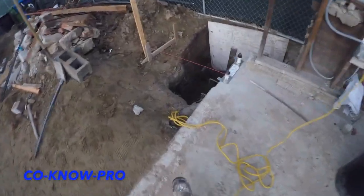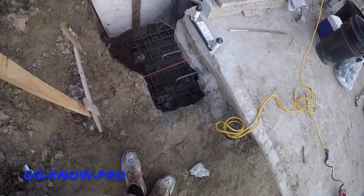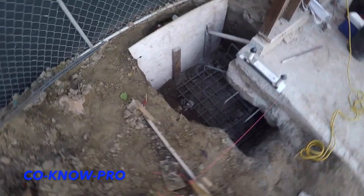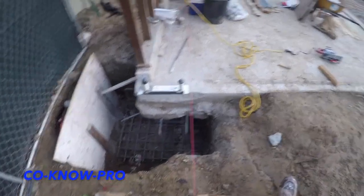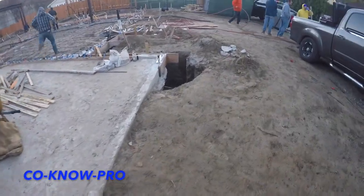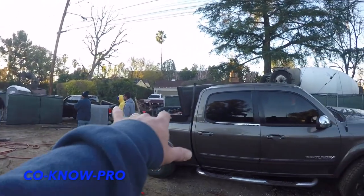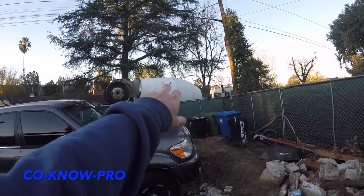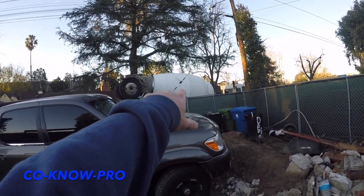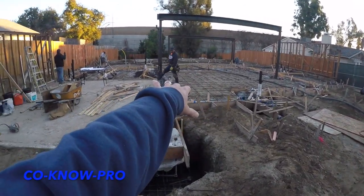We've got this pad right here — this is an under pad ready to go. They don't need stiffeners in that one because it's going through the existing footing and that's going to hold it stable. Another under pad right there. Everyone's rolling out the hose right now. We got the pump showing up — already got one truck ready to go. Probably going to have about 11 to 15 trucks come through and fill this pad up, probably over 100 yards of concrete.